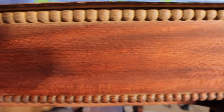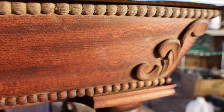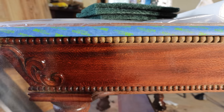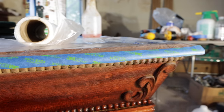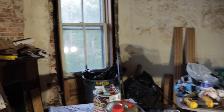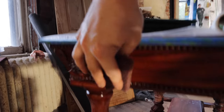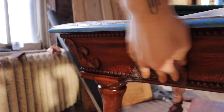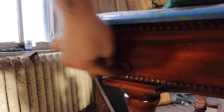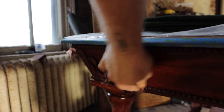I want to quickly show you what the flusher does — that second blue product. There are some drips and not everything is fully off, so I spray the flusher on just like the stripper. All this is doing is neutralizing the stripper. When it dries it does not raise the grain at all. Then I take a little scuff pad, fold it over for a better grip, and rub away — this is removing all the last little bits of stripper and anything else on the wood. Get into the corners as best you can, then go over it with the nylon brush once more.